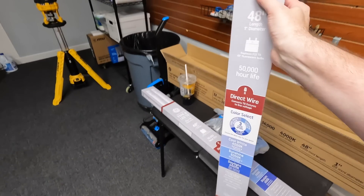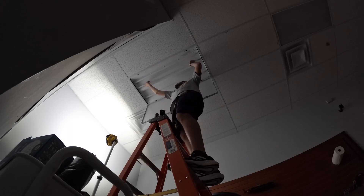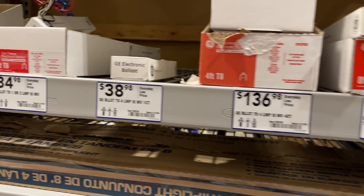All of the light fixtures out here are now changed out, as well as the two up above me. The one that wasn't working is this one right here. I bought direct wire replacements for it — a retrofit where you take the ballast out, tie the two sides into hot and neutral, and then pop in a new LED bulb that runs right off line voltage. Lowe's was out of commercial electronic ballasts and only had residential ones, so I went with the direct-wire retrofit instead.